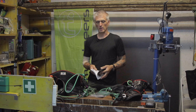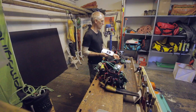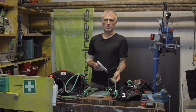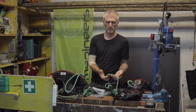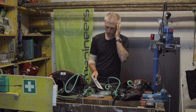So that's clear enough. There are obvious fail criteria, such as a cut to the cover or severe abrasion damage. In regards to contact with hand saws, I'd like to clarify that any contact with a hand saw blade ought to be a fail criterion, because conceivably the teeth of the hand saw could puncture through the cover without leaving any visible damage and have actually damaged the core. So in our opinion, any contact with hand saws should be an automatic fail criterion.